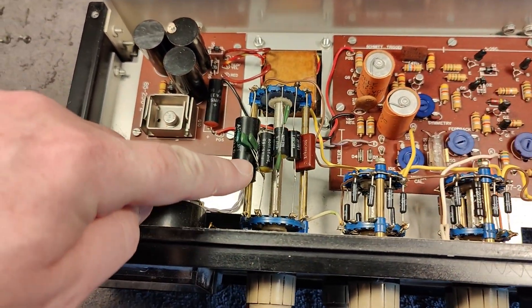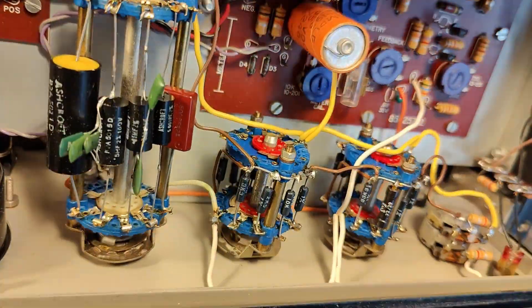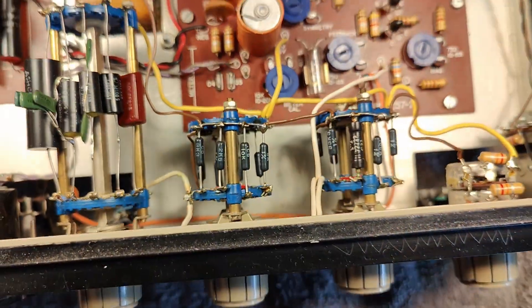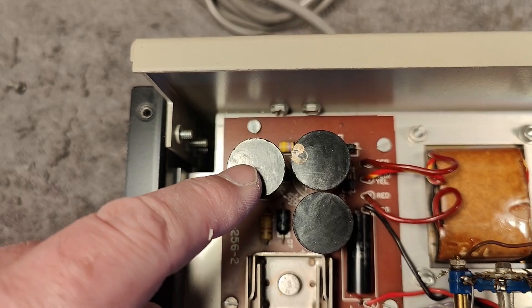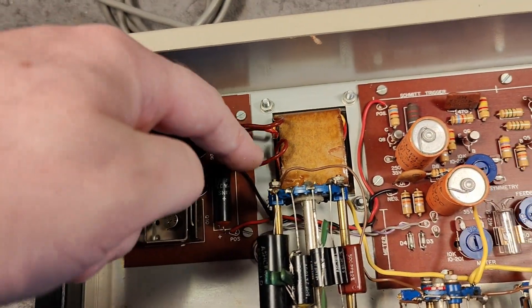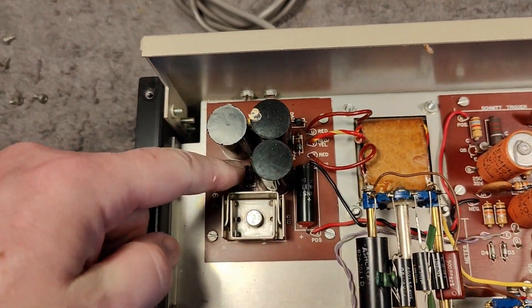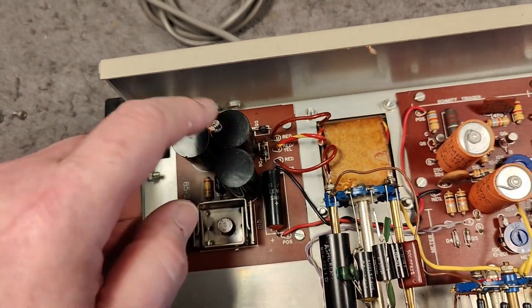But of course, this is also a kit, and one of the design goals I would expect is to teach people how to do things really, really well and smart. I can see some adjustments are done here to the different multipliers. We've got some funny wires and some green slime that reveals somebody's been trying to clean the contacts. I also see this capacitor here is cracked, and I bet all those capacitors are more or less long gone.